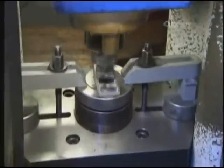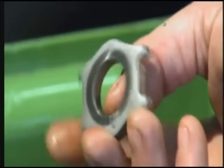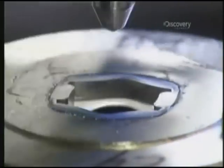The steel strips are an inch and a half thick and are molded by a 125-ton press into the outermost case of the watch. Stainless steel is steel that's been mixed with a hard metal called chromium to protect it from corrosion and rust. Stainless steel can also be polished again and again to keep the finished watch looking new, and this steel has a little carbon mixed in as well to harden it while still leaving it malleable enough to be molded.